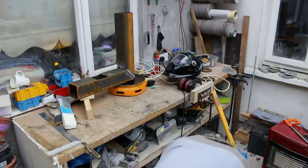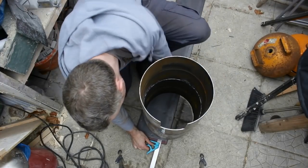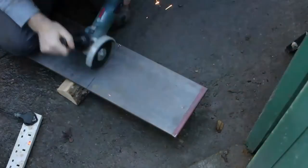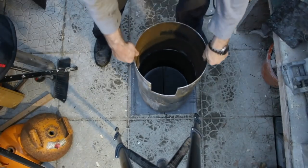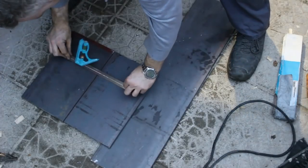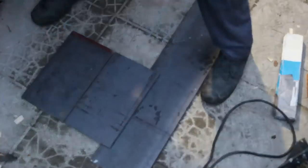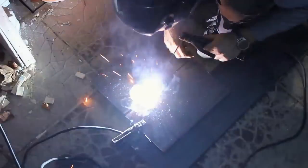This is a piece of 8mm thick steel that I got for the top of the stove so I have a flat top on it. I laid the cylinder on top and measured 20mm from the side, the top and the other side as well, then I cut this off. This metal was so thick it took forever to get through and I think I used more than one disc to do it. I make a second identical piece and then I weld them together. The heat from welding on this side seemed to make them warp and pull together, which meant it wasn't completely flat — but it was nothing that a bit of jumping up and down couldn't solve. Then I welded the other side and it was done.